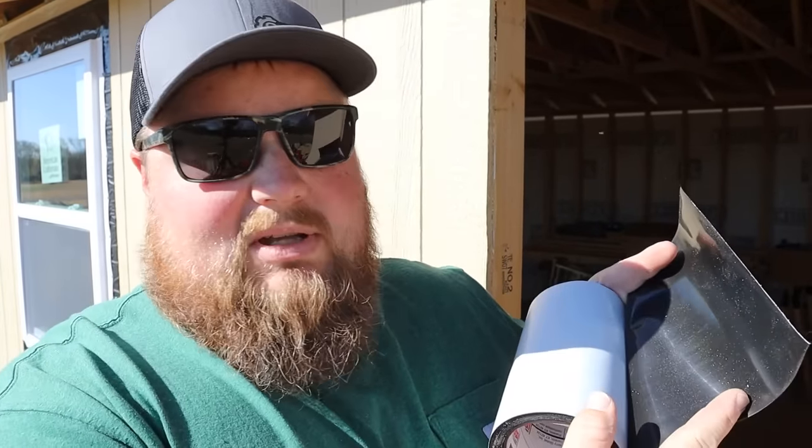The prerequisite work is to have your window, have your structure framed up correctly, your siding cut, and basically have yourself a hole, your window, and your supplies. I've covered all of this in previous videos of this full workshop build playlist — there's a link down below. Step one is to flash it out — flashing tape, that is. I like to use six-inch wide rolls, but they're also available in four, eight, and ten inch widths. Flashing tape is a waterproof, super sticky tape membrane that acts as a water barrier between your building, siding, window framing, and moisture. The order of steps: start with the bottom, then left side, right side, install your window, then the top piece.